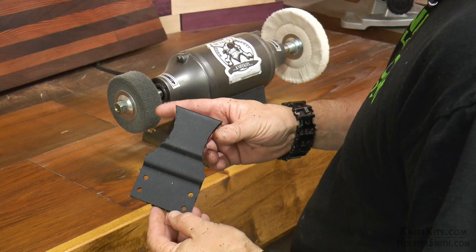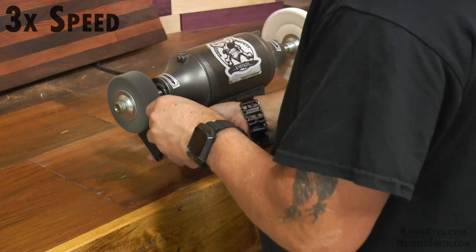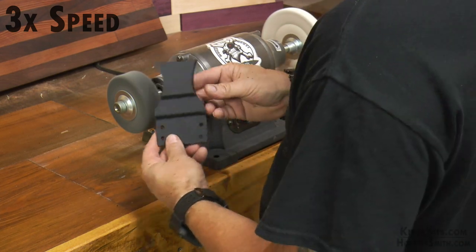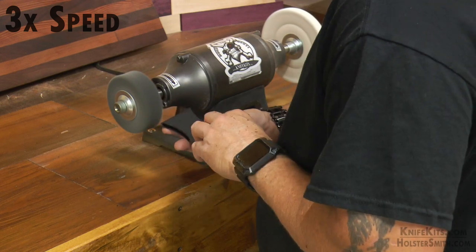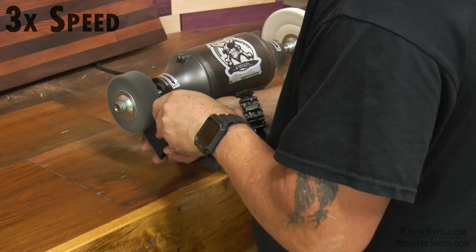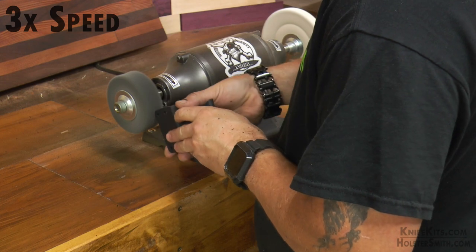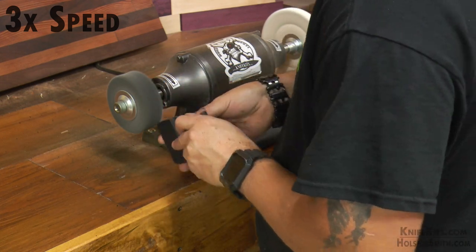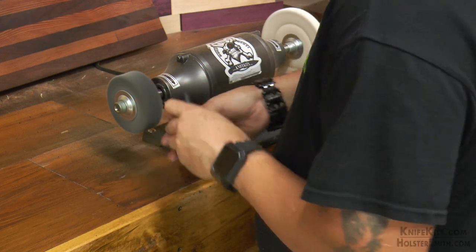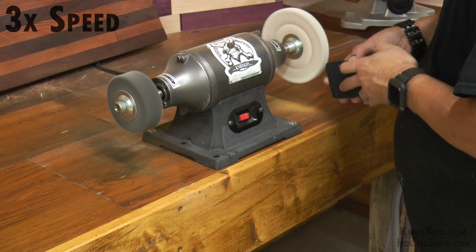Because we were using a narrower blade bandsaw, we're able to come right over to our grinder — we've just got a sanding wheel on it — and use that to get an even curvature on both sides. It's also smoothing out the Kydex and taking a little bit off. Depending on the type of sander grinder that you have, you could also do this around a pulley — like if you're using our Kalamazoo sander grinder, you can do this right around one of the pulley areas, which gives you a nice even curvature as well. Note that the wheel we're using here is not a rough sanding wheel — it's not quite a polishing wheel, but it's pretty close. Since we've already got the shape we want, this is really more just to smooth out those edges and give you a better look. Then we're going to take it over to our polishing wheel to polish it up.